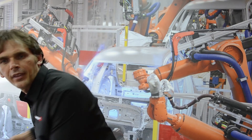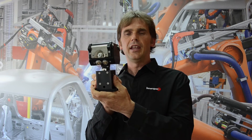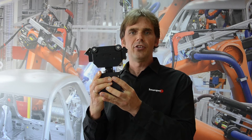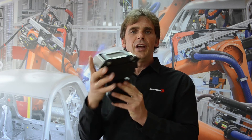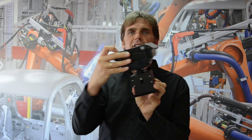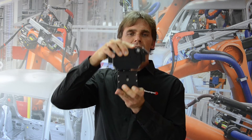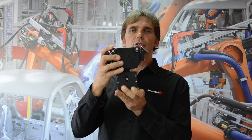Just before giving you a demonstration, I'd like to introduce you to some hardware. This over here is the sensor that we use in our industrial weld inspection system. It's a very robust sensor and has to be positioned on the material immediately adjacent to the weld seam — it doesn't travel directly on the weld seam, it goes adjacent to it. You can see here that the sensor contains some wheels and also has a spring unit in order to give it some compliance.